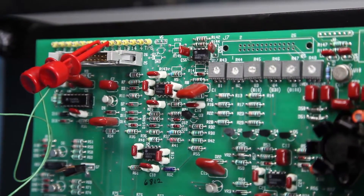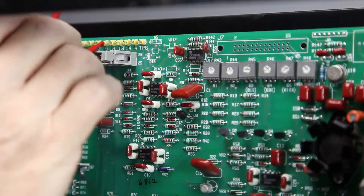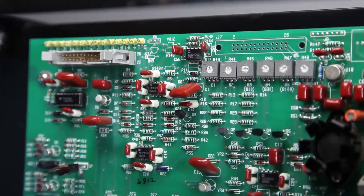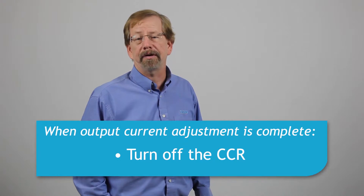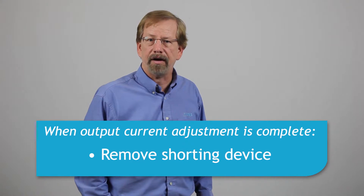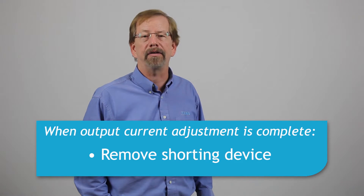Turn off the CCR and remove the jumper connecting test point 7 and test point 9. The trip level for the overcurrent threshold is now calibrated for 6.93 amps. Note that potentiometers R43, R44, R45, and R46 have independent circuits, so any adjustments made on these potentiometers will not affect the adjustment of the others. When the output current adjustment has been completed, turn off the CCR. Set the series cutout to the normal operating position or remove the shorting cable on the CCR output if used. Reconnect the airfield circuit and verify that the calibration is correct at all steps. Note that for a 20-amp regulator, the procedure is the same, except that R47 will be adjusted for 20 amps, and the remaining 4 steps are adjusted as demonstrated in this video.